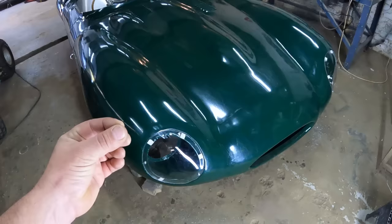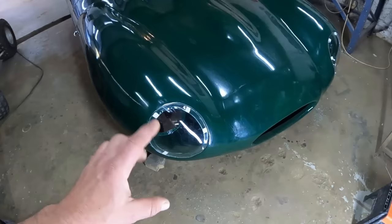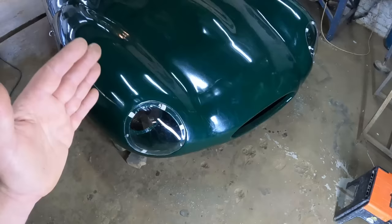The other thing that I've learned is that it's very important to use a cotton rag, otherwise the imperfections of the mold are definitely going to imprint into your glass. Another thing I found out was that making this very bulbous shape was nearly impossible in one go, so I had it in the oven, took it out, nudged it into position, and then put it back in the oven and took it out again until I found this perfect shape. But guys, like I said, this is just how I did it. I'm sure that there might be better ways.